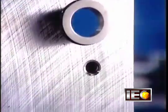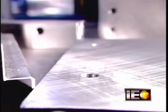A mold usually consists of two halves, each of which is comprised of several components. The factory drills strategically positioned holes in the bases for the guide pins and bushings that hold the components together when the plastic's injected. A grinder now goes to work smoothing and leveling all surfaces. This prepares the base for the high-precision machining operations that will transform it into a mold component.